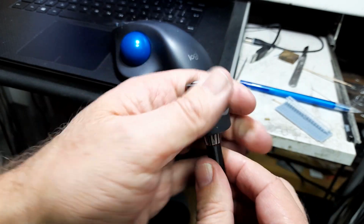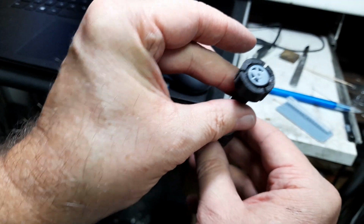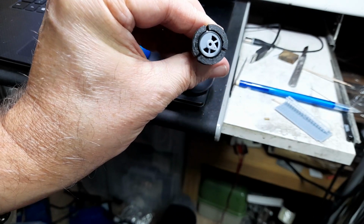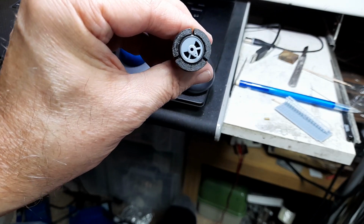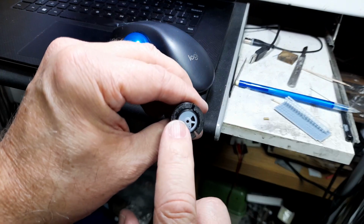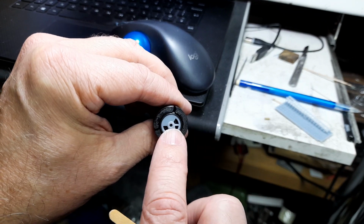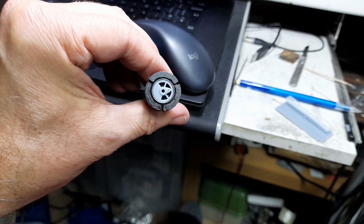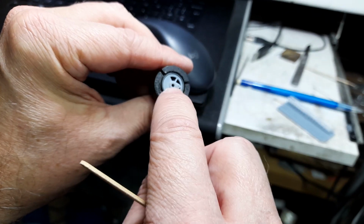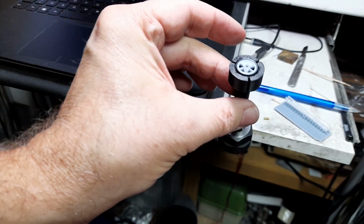And obviously it was more or less free to do, and I can print these any size I want. So I'm quite pleased with that, and that's what I'm doing with the wheels. Now I use a 2mm axle out of preference for my stuff, and of course the 14mm gauge one has outside cranks. You'll notice this also has outside cranks. That is correct. Even though it was an inside wheel, it was still cast with outside cranks, and in fact they just had a blind pin to blank that off, much to my surprise, but that's how it was. But I shall also print one of these with a crank shape for truing up the outside cranks in exactly the same way. So that's that.